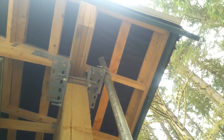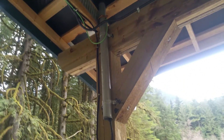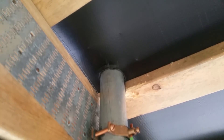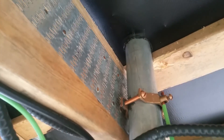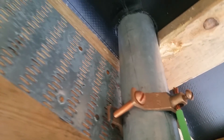He cut the hole — it's like a square hole. Anyway, let me go back to my antenna. This is not an instructional video, so I'll be all over the place. This is the first antenna I installed today. As you can see, I drilled the hole — you see some silicone sticking out. This is not a roof repair caulking material; it's flexible silicone around the mast. It's not really necessary because it's all outdoors, but I had to notch a bit of that wood — at least it's leaning against solid structural material.